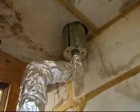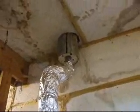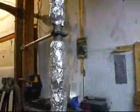The chimney is fence post tubing — similar to exhaust-type tubing — and it's insulated as it goes up to keep the creosote from building up. It goes up to a 6-inch flue through the roof. I have a steel disc there centering the 2-inch pipe inside the 6-inch pipe, and the 2-inch pipe runs all the way up above the roof to keep the 6-inch from getting very hot. It's effective — I've been up there and felt it when it's burning, and it's pretty good.